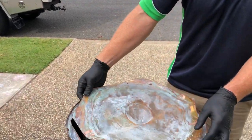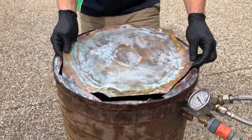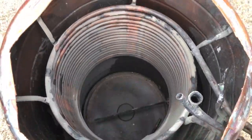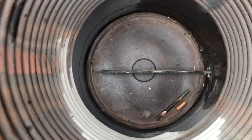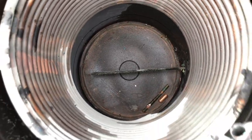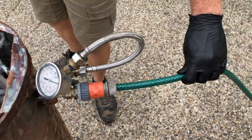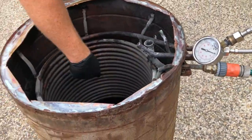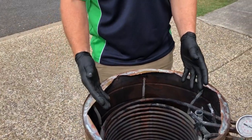So we've cut the lid, taken the casing off, and we've cut the top inner tank lid out. Pretty basic — we have down the bottom the element, that's the heating element, just like in your kettle but a little bit bigger. We have the cold water inlet pipe which comes in, goes down the bottom, heats around the coil. The water inside, which is heated by the element, heats the coil, which in turn heats the water inside the pipe which goes to your outlets.